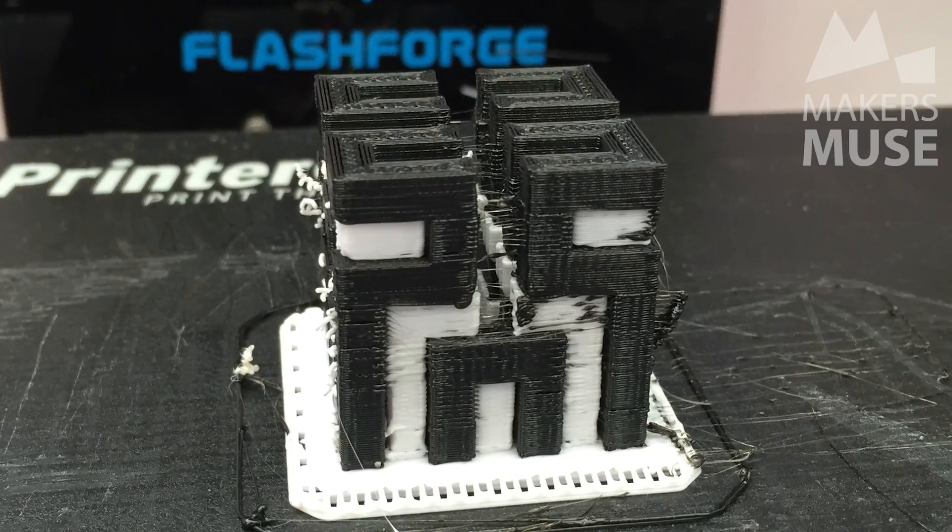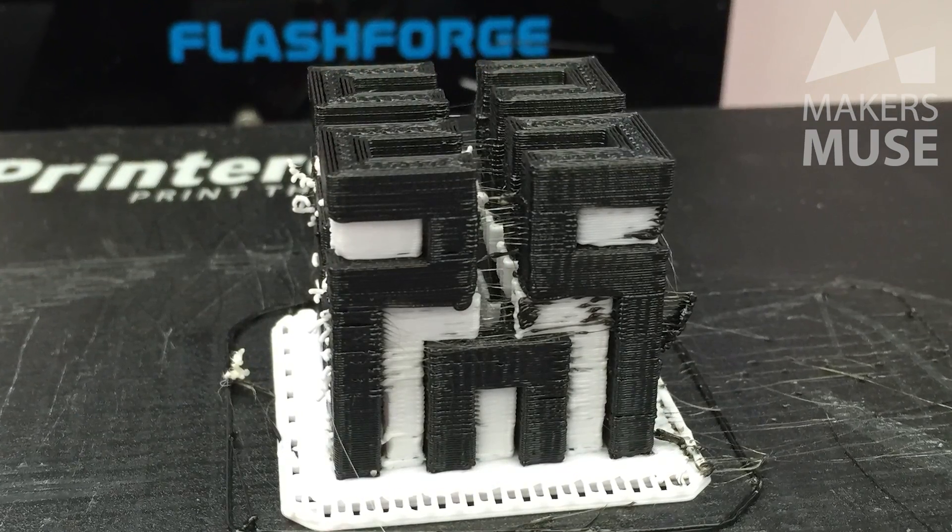I don't even know if you can get stainless steel nozzles for the FlashForge Dreamer, which is what ColorFabb recommends, but don't let that scare you — it actually prints really easily. I haven't had any warping issues with it. I haven't tried printing supports with the carbon fiber; I've always done support with ABS separately in a different nozzle on the FlashForge. In terms of rigidity, I've never seen any FDM prints that rigid — it's absolutely insane.